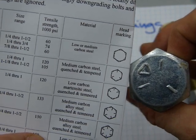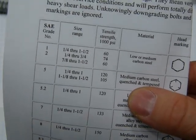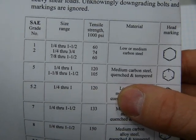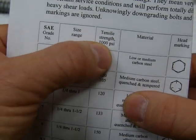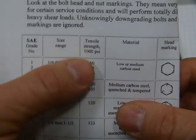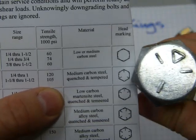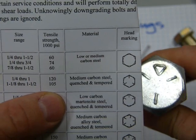Three whiskers here, three whiskers in the picture. And you can see the material of the bolt — it has to be medium carbon steel, it has to be quenched and tempered. Not only that, but it has to have a tensile strength of 105,000 PSI. That's how these numbers read. So for this bolt — it's tensile strength must be 105,000 PSI, because it is bigger than an inch and an eighth.